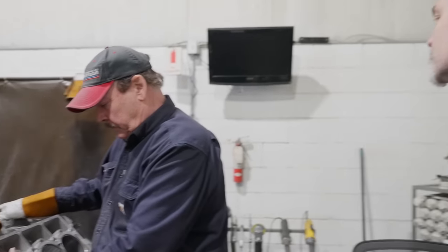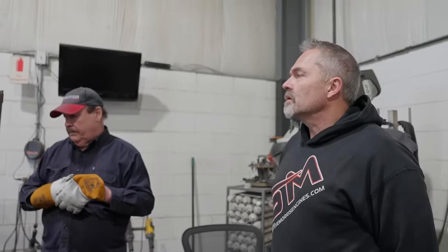Then the one thing that I don't see here is the ovens. No. So I don't understand. It seems to be generally held that you have to have an oven to preheat, post heat, all that other kind of stuff. Yeah, that's kind of old school. We used to preheat everything because the welders weren't capable of melting the aluminum. And that was a real need to preheat the aluminum. But with the technology with inverters and shielding gases, you really don't need that preheat like we used to.